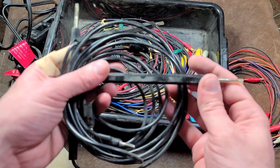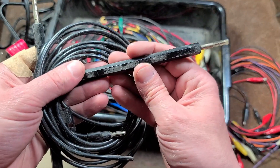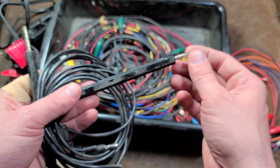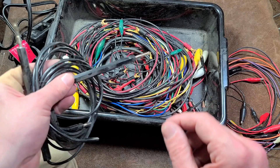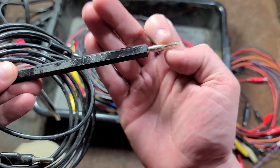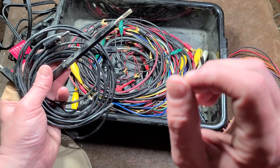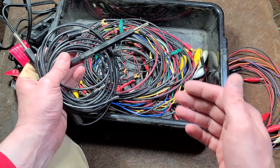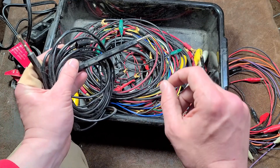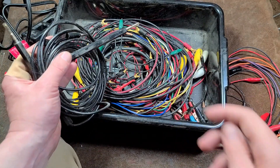Here are some more Pomona items. These kind of look like cheap multimeter probes but they're actually power delivery probes. They have the standard banana plug, and they're heavy-duty probes for situations where you need to deliver power — say you've removed some components from a circuit and just need to deliver some power, potentially at a little bit of high current. These are 12-gauge cables. The tips are really short and thick so you can put a lot of pressure on them since you're attempting to deliver energy with the probe. Say, put 5 volts or 18 volts right to a portion of the circuit. Really good for testing relays — you can deliver power right to the relay terminals and see if it clicks.